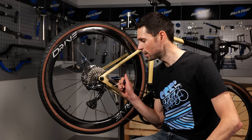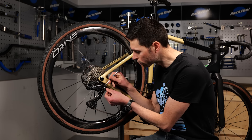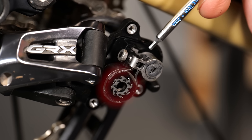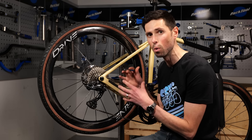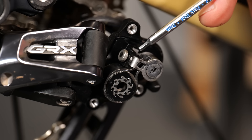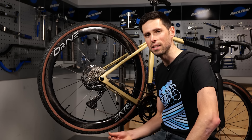When it comes to how to make the adjustment and how much adjustment to make, it all comes down to this small little screw here. The more we wind this screw in, the more force it's going to apply to the small band which clamps around the clutch unit, which means more force is going to be required to overcome the clutch action. And if we back this screw off, well less force is going to be applied, so the clutch is going to be less effective.